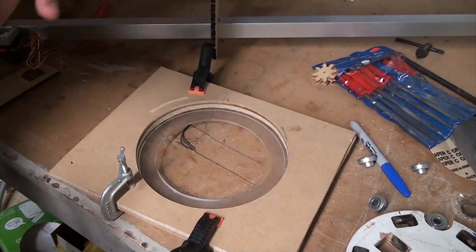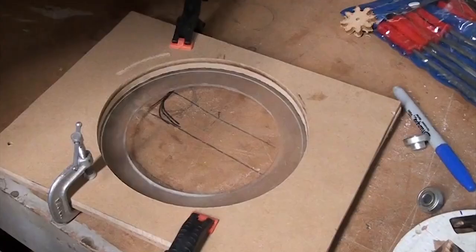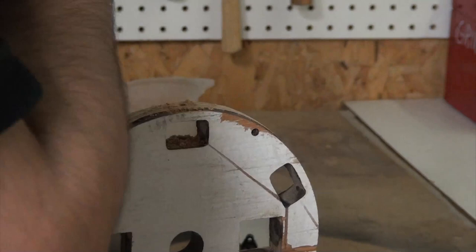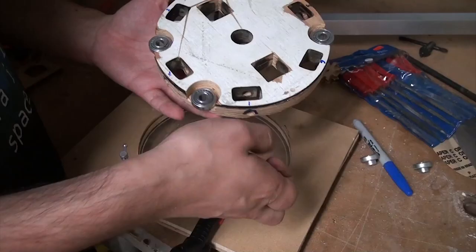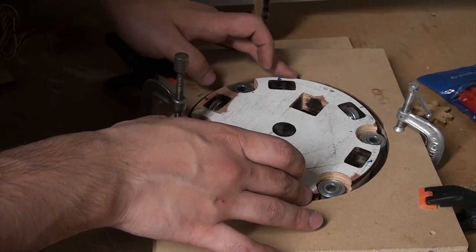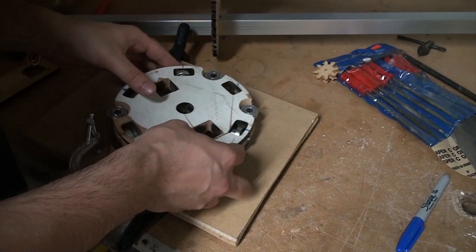For this part to function, it needs a track to sit in and rotate in. When I first did this, I just used what I had on hand, and that meant cutting three pieces to layer so that things fit properly and were the right height, but I'll be remaking this and milling the final version out of a single, thicker piece. Basically it's just a lower plate that the vertical bearings can run on, with a big hole in the middle so that the vertical supports can fit through, and then a wider inner diameter upper plate for the horizontal bearings to roll in and keep everything centered. To hold the vertical bearings in place, I cut a couple pieces of steel rod and drilled holes into the side of the part to accommodate them. They were gently tapped into place to lock the bearings in — I left a little bit overhanging so they could be removed if necessary, but the fit was tight enough that they shouldn't come loose.